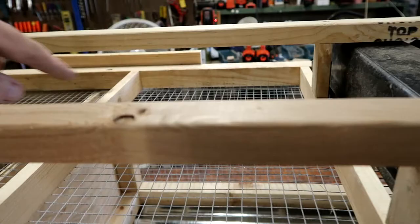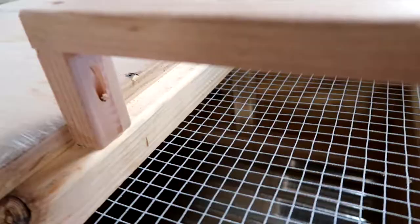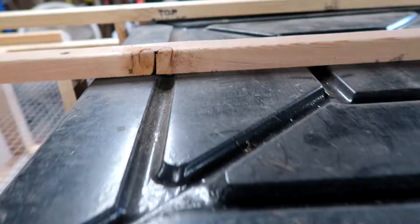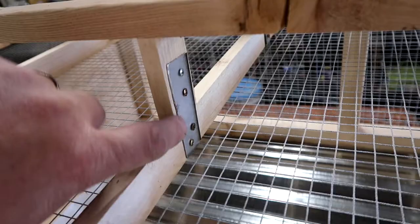This is the front — it's upside down. This slides in. There is that catch — you can see right there, there's one on this side so it keeps it from pushing in too far. The way I attached it was I had these risers and I used a pocket hole with a Kreg tool. Then here in the middle, I just used a piece of metal to attach this thin piece. So there's a screw, another riser here with a screw, and made two rows — and that's it.